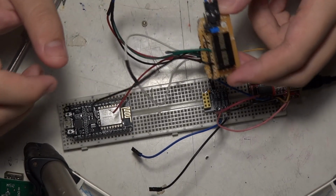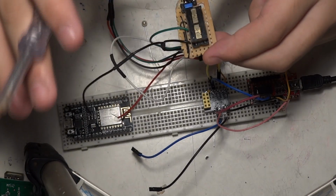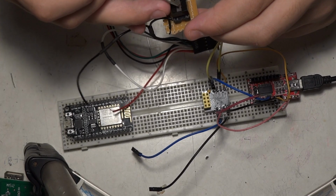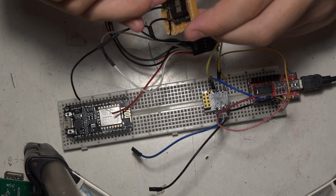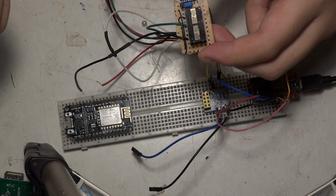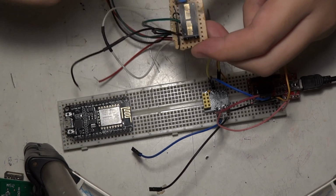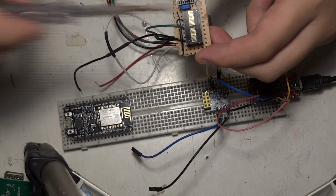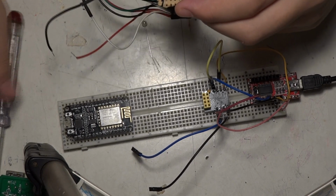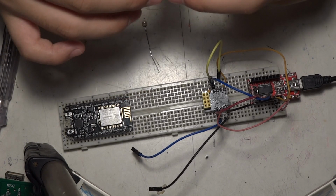This is a very small display. I will not talk about the size, but about the number of dots on the display. More dots need a faster screen, a faster shift register, or multiplexing to scan across the display to get a very high refresh rate. This one has 5 by 5 dots, which is very easy to drive.